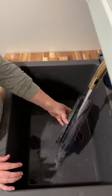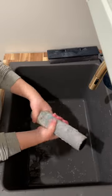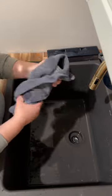This is the really important part. Once you've rinsed the roller, wring it out first by hand so there's not a lot of excess water just sitting in the nap. Then wring it out with a towel. That will speed up the drying process to ensure it doesn't smell.